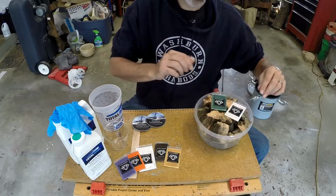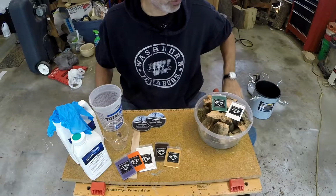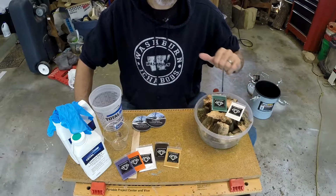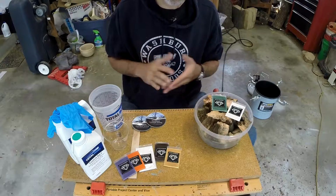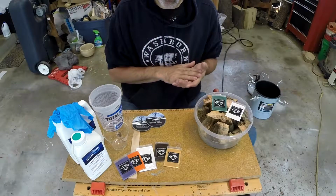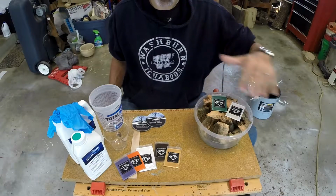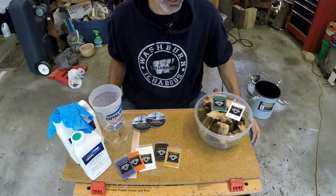So these are the two colors we will be using with our stump, mostly rotted stump, but there's some really good textures and qualities and colors in here, so I'm excited about this. But this is what we'll be doing with this piece for our project. So we'll be mixing these all together. I'll separate them out. The Total Boat Thick Set has approximately 10 to 30 minute working time, so I'll actually be closer to the 30-minute time period on these before I start pouring, because it is a little bit cooler than 80 degrees. I'll just kind of be watching that, and then hopefully we'll get some good swirling throughout with the colors. I'm going to use more of the Hunter Green and a little bit less of the Ghost Sapphire Blue, but hopefully, like I said, we'll get some good swirling through that, and we'll see how much actually gets absorbed up into the wood also with all the nooks and crannies that are there.